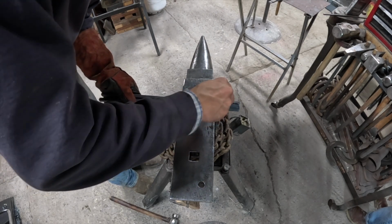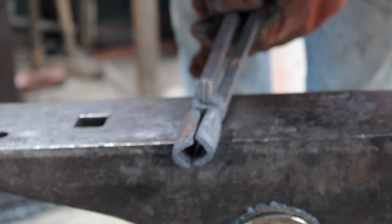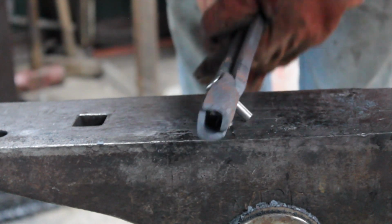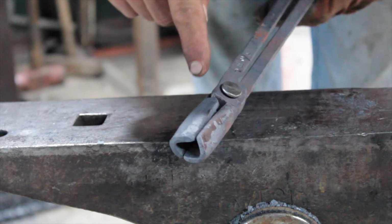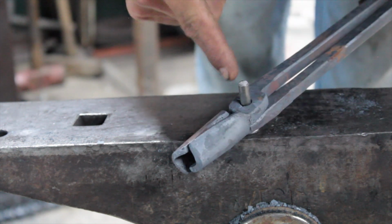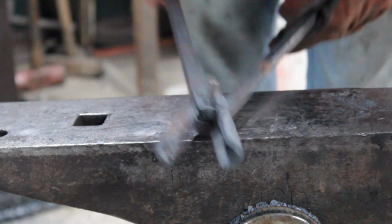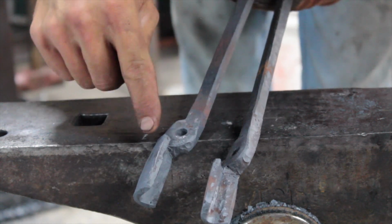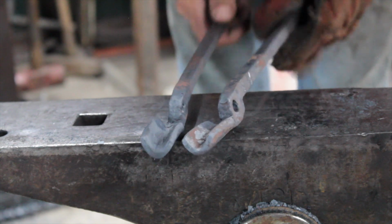Before we rivet these puppies up, we want to make sure we're clearing everywhere. Little adjustments after we get done riveting, but I'm pretty clear all through there, which is a nice tight gap, so it's strong, but you have clearance. But there's a lot of this unsightly stuff that I'll hot rasp up that just kind of looks nasty. My rivet wants to live there. And then we'll round off all these edges so there's nowhere for it to bind once they're riveted up. Anything you want to clean up now, you need to clean up now.